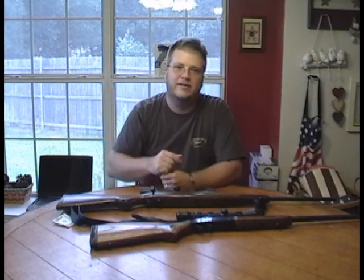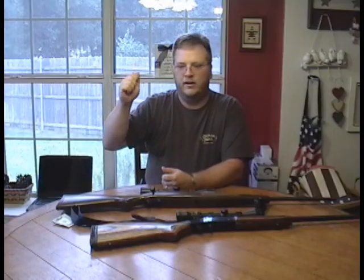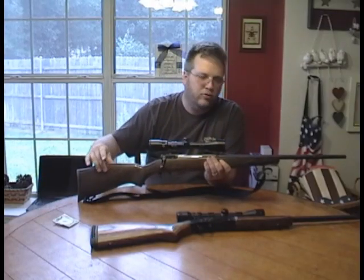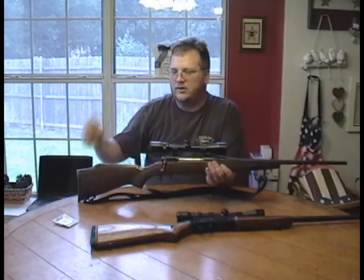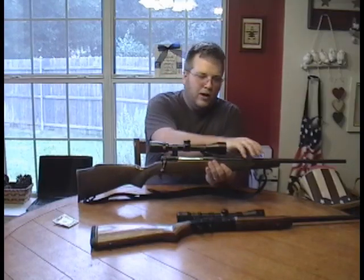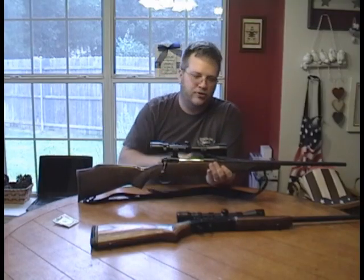The problem is what's called harmonics — that's how closely, shot to shot, the barrel vibrates and oscillates in the exact same way. If I take a steel rod and smack it on the ground, it's going to vibrate. When I smack it again, it vibrates slightly differently depending on how hard I hit it. What happens is if you have a wood stock and you're in a humid situation, the wood swells just a little bit — you really can't even tell with your eyes, but it happens. The pressure on the barrel changes just a little bit, and that changes how your barrel responds. What we're doing by floating the barrel is not removing the oscillation — we're letting the barrel simply oscillate the way it's going to anyway, without it coming into contact with or having any type of pressure on it. That's what improves the accuracy.